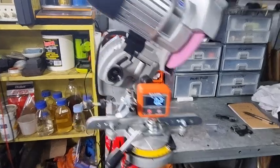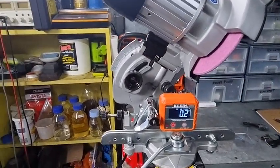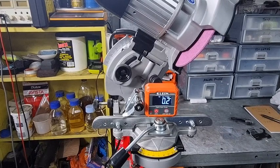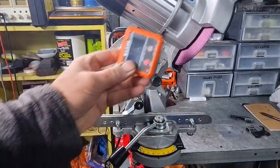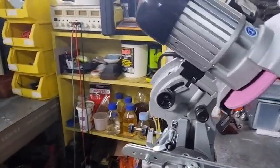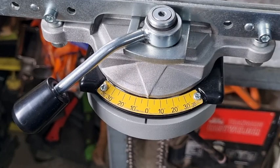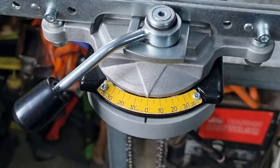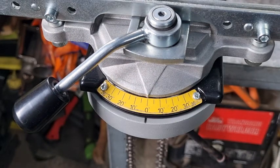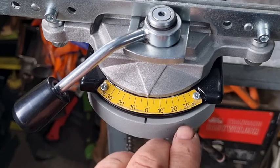I think you'd probably agree with me that the markings on the back here are pretty spot on. So that was my 60-degree mark - 60 degrees is where I normally leave it, I don't grind at any other angle. That's excellent, that's perfect. I've actually measured these angles here with a protractor - a laser-etched protractor - so it's very accurate. I've taken this vice out and measured from underneath with these graduations: spot on. Can't find an error. If there is one, it's so marginal it's not even worth worrying about.